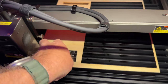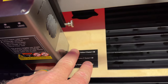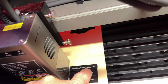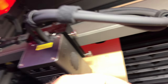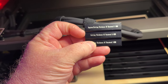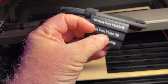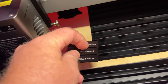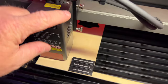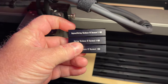This little metal piece is included and it's got different thicknesses — that's how you calibrate the distance from your material to the actual laser head unit. You lay it flat, place it over the measuring device, and adjust the distance between the edge of this and the top of whatever material you're using. There are three settings: engraved cutting of basswood 1–3mm, cutting of basswood 4–6mm, and cutting of basswood 6mm. This is very important — if you have it too far away, it's not going to cut or burn efficiently. Don't lose this tool.